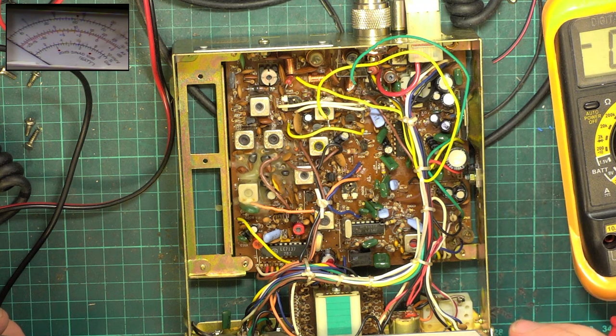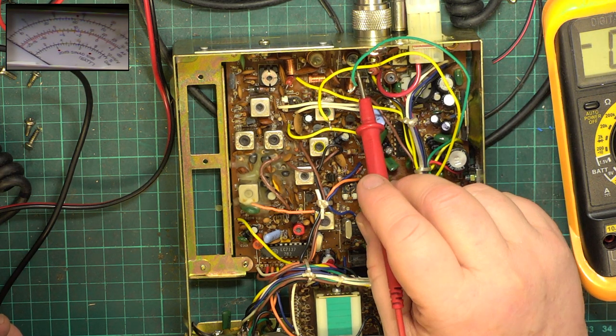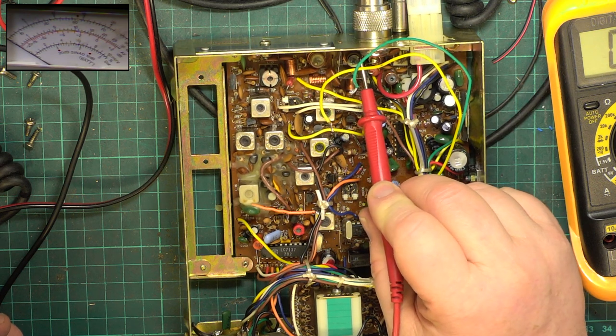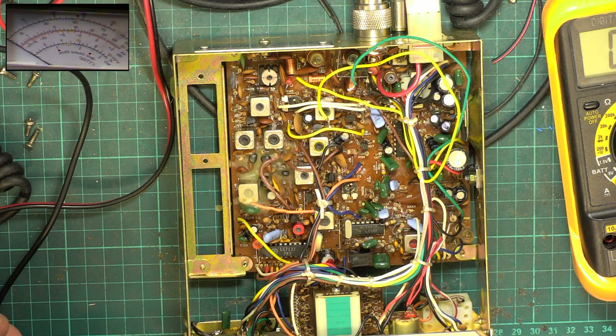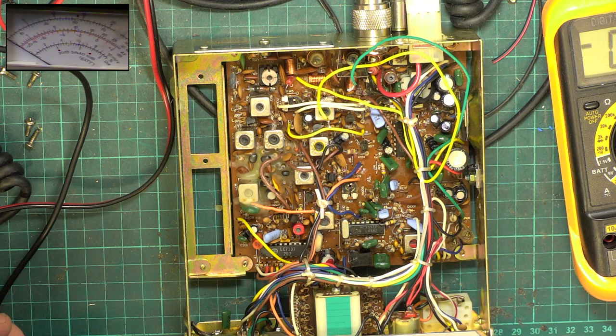We'll leave this radio on overnight. So I've tuned it. It's doing 4 watts. Just need to verify with the service manual with that coil whether it needs to be clockwise or anti-clockwise. So I'm satisfied the receive is now there. I don't like crystal filters as a retrofit item, I'm never sure whether they're right or wrong, but it's receiving, so hey, it stays, doesn't it? It's not like it's illegal, but it isn't playing up for me.